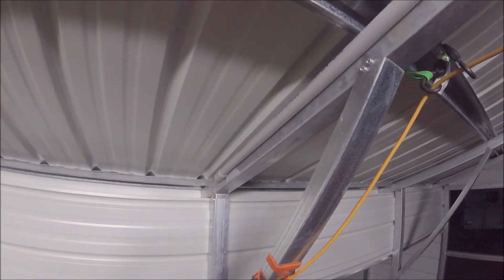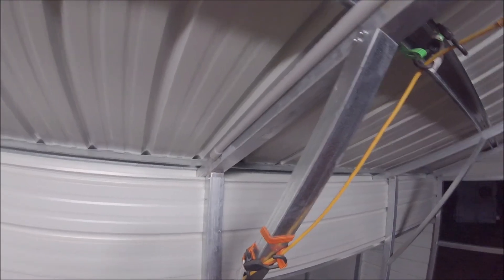For today, I had to get a box in there. Got a box and three-quarter tubing, which allows you to kind of bend it without having to put in an offset, 45, or 90 — just lets you do the gentle bends through three-quarter pipe. Like I said, I'll put a 90 in there, drop the box, and keep on trucking. Did the same thing over there. So we're coming along.